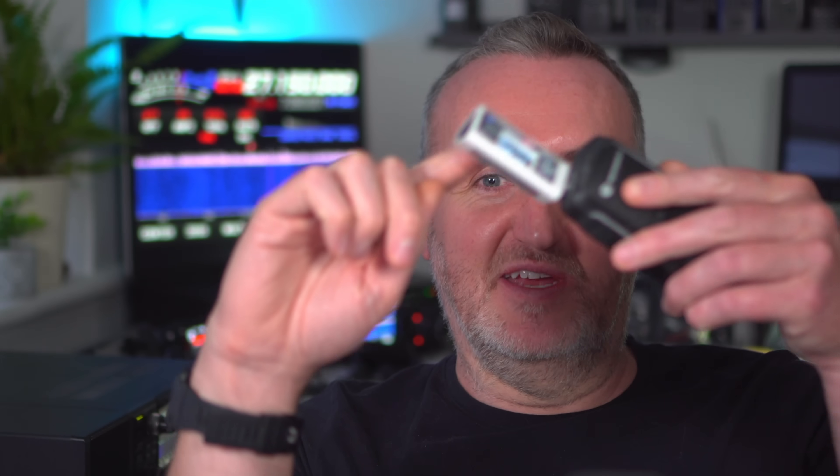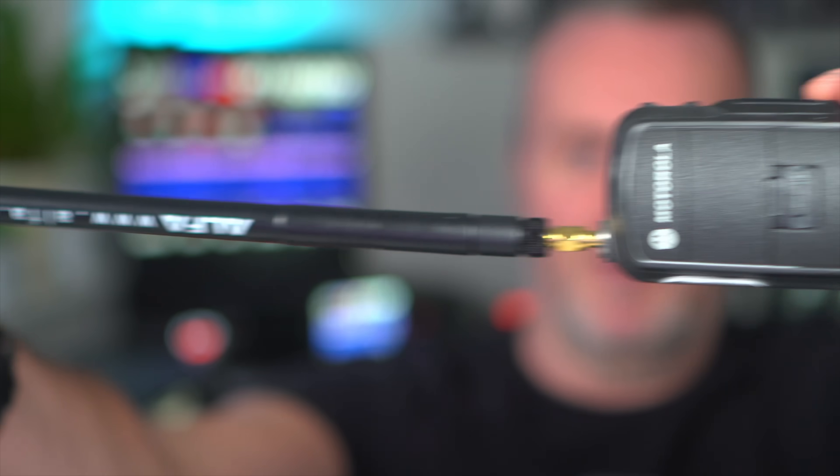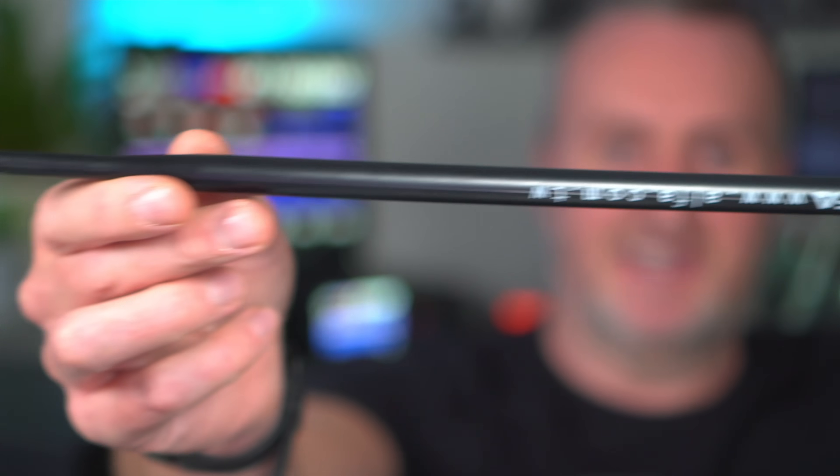Pretty fascinating stuff. And these radios have now been discontinued — you can't buy them anymore. I suspect the main reason is actually use case scenarios. 2.4 gigahertz is actually quite a high frequency, so it will be subject to getting blocked by buildings and anything that comes in the way. So it's very much a line-of-sight sort of system. But utilized correctly, and I've got a little power meter here to show how much power these things put out — they have got an external antenna port on the top. And because it's basically Wi-Fi frequencies, you can use any sort of Wi-Fi router high-gain antennas like this one here.